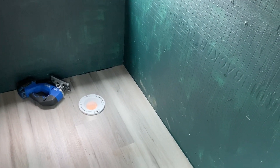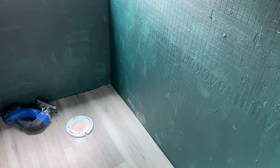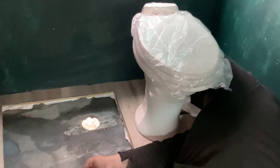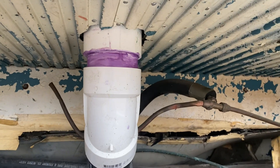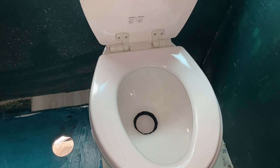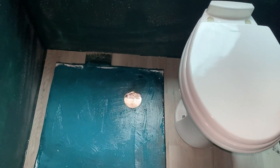The toilet flange is ready to go in and the flooring is in the bathroom — it is 100% waterproof floor, and we also put the membrane underneath just in case. We got the cutout for the sunken shower section. The black tank connection is made; the toilet just needs its fresh water supply now. We flushed it — the toilet is working. We also have more liquid membrane down where the drop-down shower is going to go.